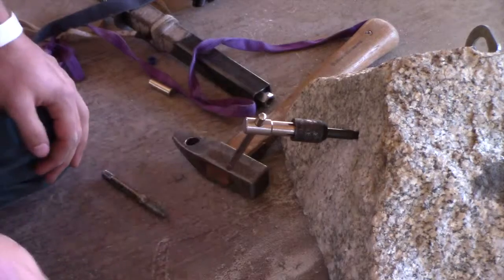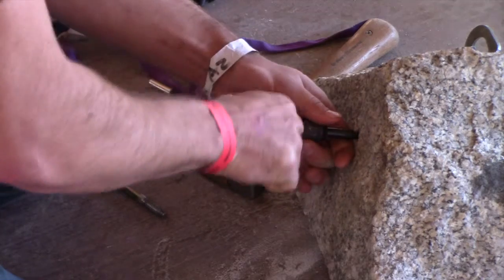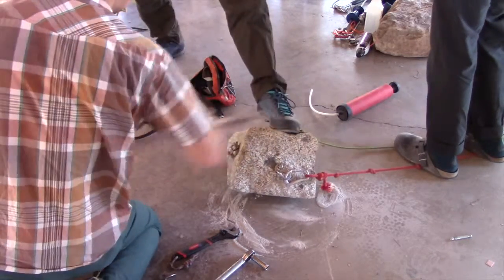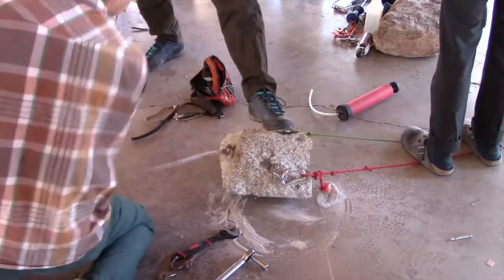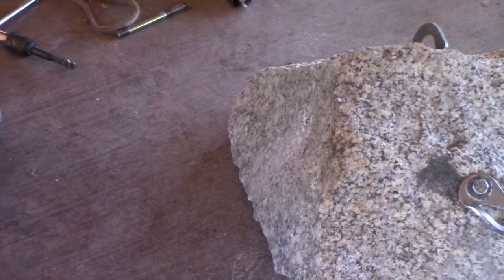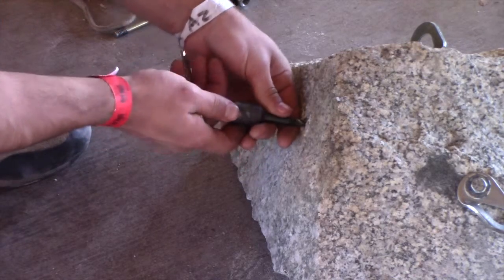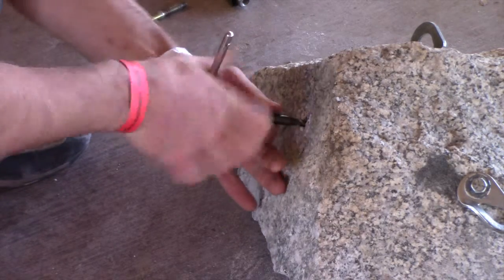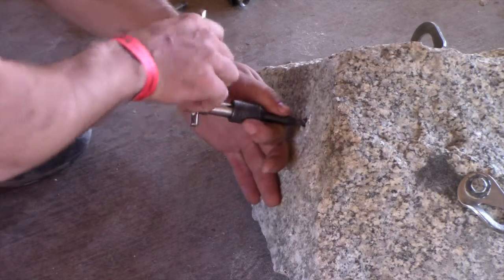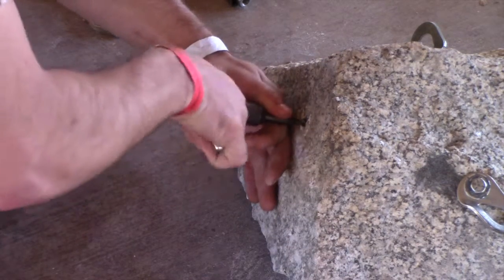If the bolts are seriously rusted, it drills through them pretty quick, though you go through a few extra half-inch drill bits and break the tips off. Re-engaging the cones, now we have a cone and a sleeve firmly in there and we can cut threads — though that wouldn't happen with an old installation; it would have been solid in the back of the hole. This happens more often than not when you do a clinic, because you're using a new bolt that hasn't rusted to the sidewall — so it's a limitation.